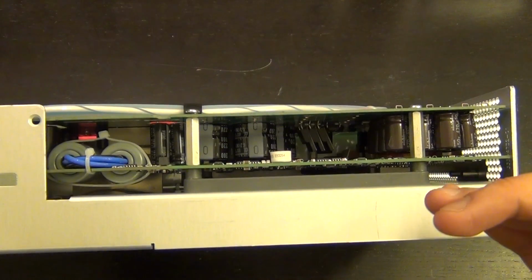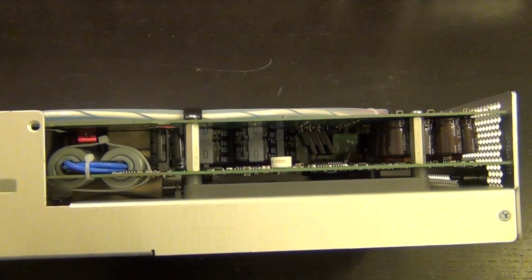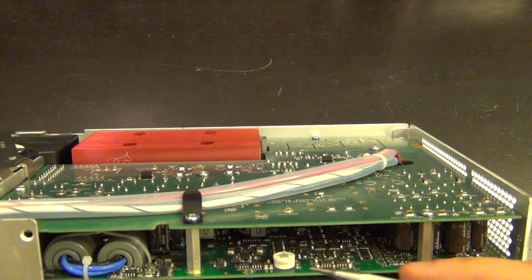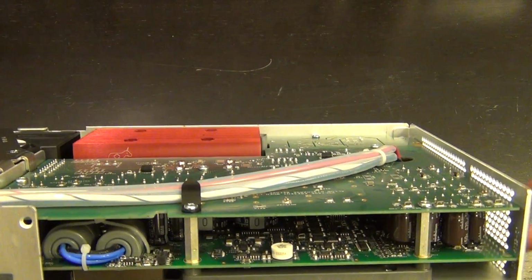but this instrument supports, just like the 2450, different states when the power is disconnected. When the output is disabled, you can have high impedance, you can have connected to zero, you can have low impedance and so on, and I'm sure this uses some of these capacitor banks. Here's a voltage reference here, what appears to be, and there's again a bunch of components on the other side.